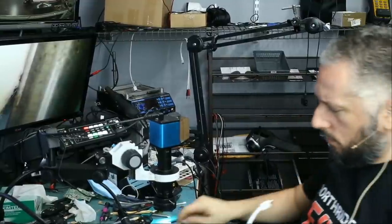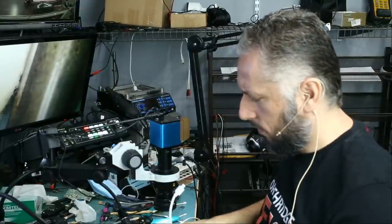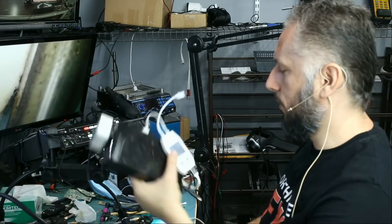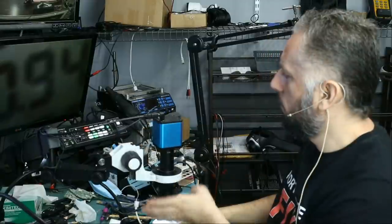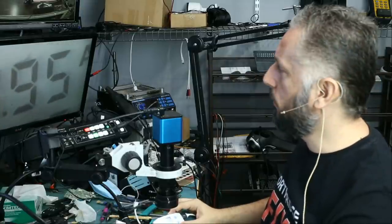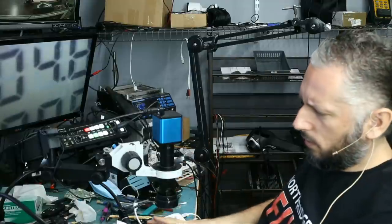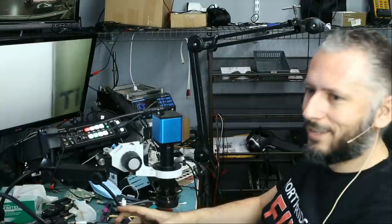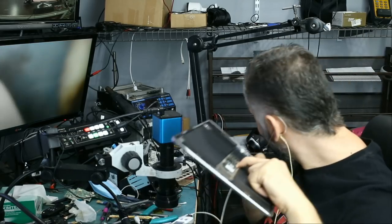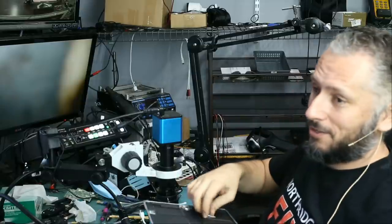Let me quickly test and see what amp reading we get — it should be in the 0.90s: 0.95, 0.97, 0.98. I'm going to disconnect the separator between the battery and the motherboard, and we have a 0.96 amp charge rate. Let me show it to you under the microscope — the charge rate is 0.95. That's awesome. The tablet is charging at 0.95 amps and that's normal. Oh, the tablet is actually on! I do not have the screen connected but it turned itself on — that's a good indication the tablet is working.